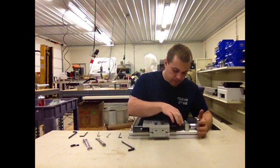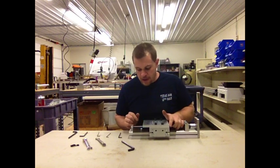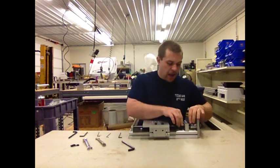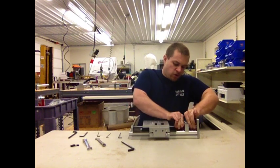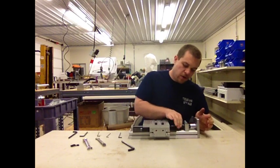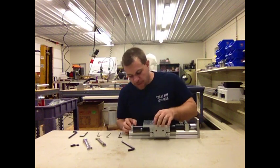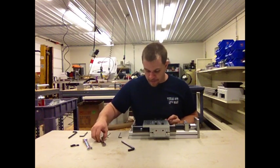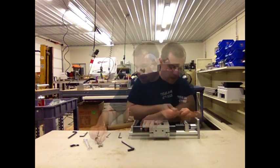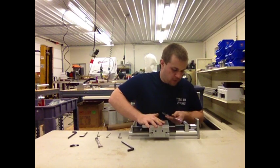After we're done, we're going to test the system. The way we test it is by turning the screw by hand — you should be able to grasp the shaft collar and turn it. If you can't turn it, that means there's some binding in the system. The solution to binding is to loosen everything back up and then loosen the big bearing just slightly.